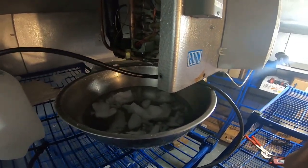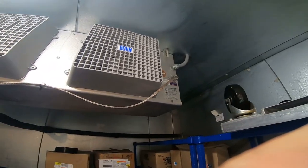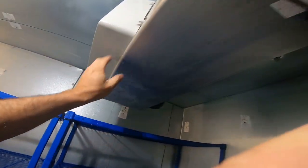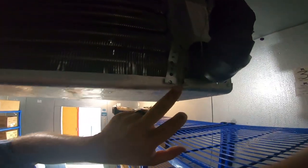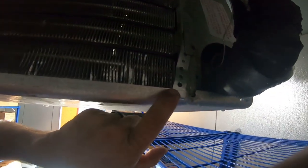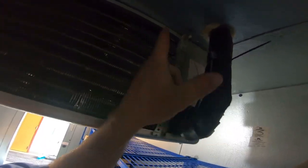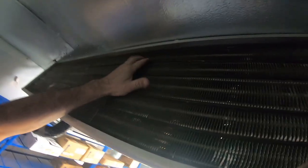Three jugs of water and we finally got it all out. Got everything back reattached, everything's taped back up here. Put a screw here into this frame, and put a screw there going into that - that's going to be held in place. Moved the thermostat back to here instead of there - that's on the suction line with the bulb up.